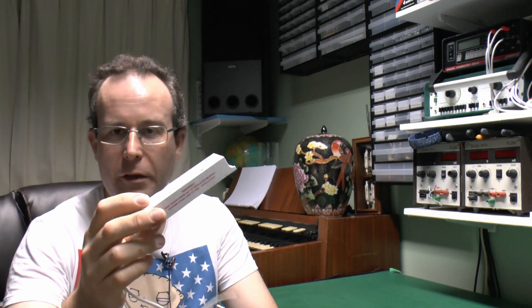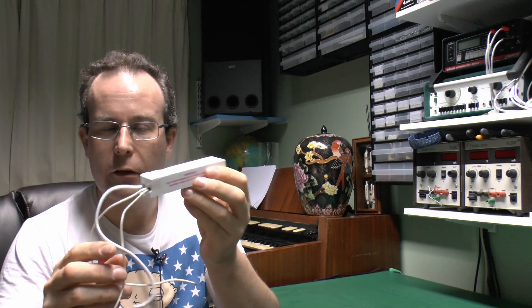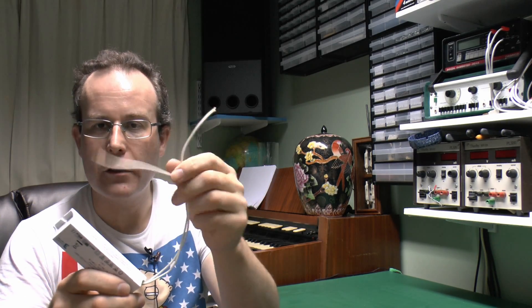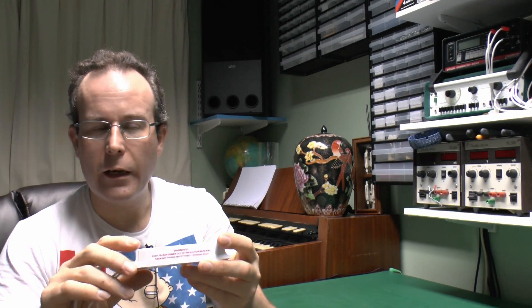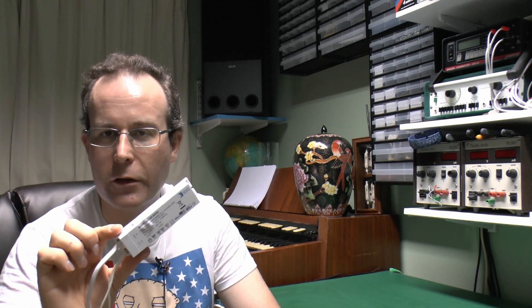Hello, I'm JW. This is a fairly short video. What I've got here is one of these switch mode power supplies used for halogen downlighters in the ceiling. Basically it's one per lamp or light fitting — mains voltage in at 240 volts, and then you get 12 volts AC on the output wires. As you can probably see, this one has melted on the side and doesn't work anymore, hence the reason for taking it out and replacing it. I thought we'd have a look inside and see what's actually failed, and also a quick look at how well it's actually constructed.